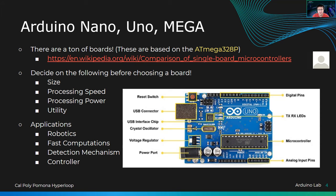Digital pins are just zero or one — GPIO, general purpose input/output. We also have PWM pins. On the right side we have the UART pins: TX is transmitting, RX is receiving. We also have different types of communication — SPI, I2C, UART, and serial communication. Pins 9 to 13 are the SPI communications. SPI requires four pins, I2C requires two pins, UART requires the 0 and 1 pins, and serial requires the USB connector.